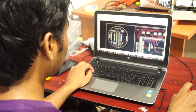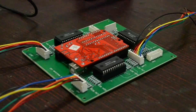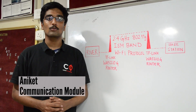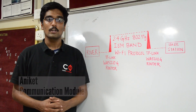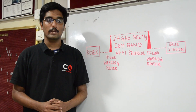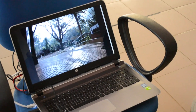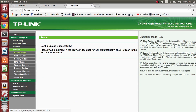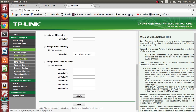The battery management system PCB is used to monitor the voltages of the LiPo batteries at the base station. In order to tackle the challenge of long-range communication, we are making use of two off-the-shelf TP-Link routers operating at a frequency of 2.4 GHz. We have been able to achieve low-latency, high-resolution video transmission. We are integrating high-gain external antennas with the routers to resolve the issue of lossy communication in non-line-of-sight conditions.